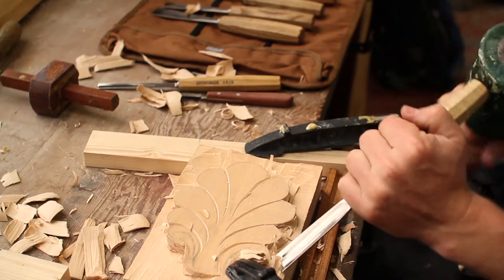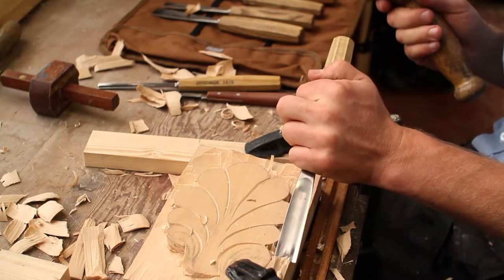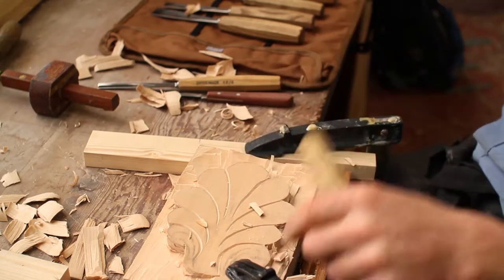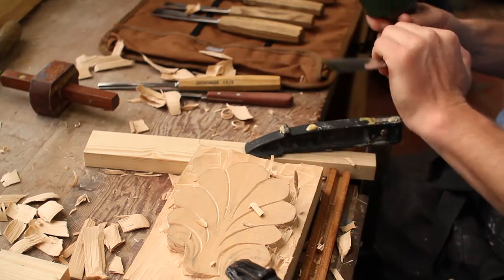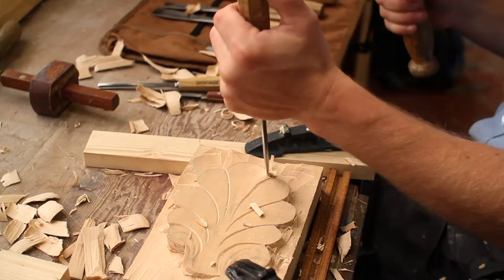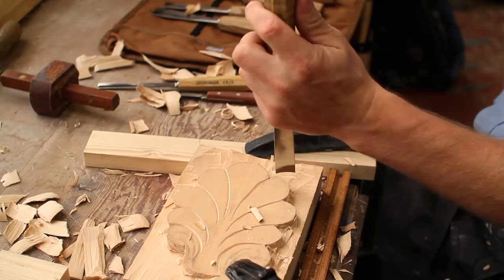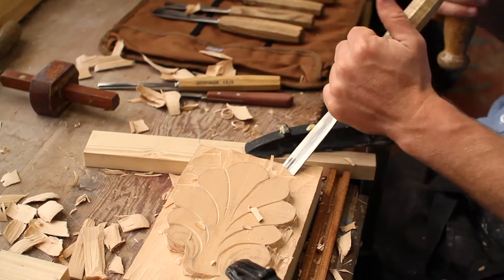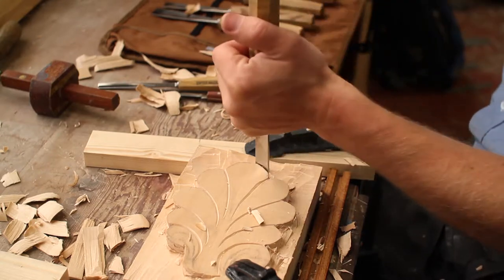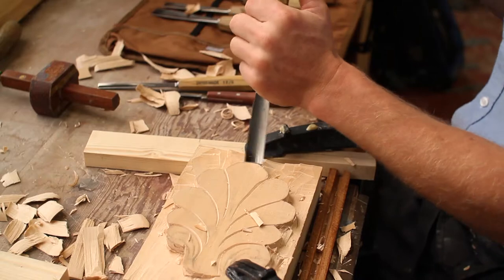It's quite a fine art with using the chisel at this stage. I'm hitting the chisel hard, but I'm never going deeper than maybe 3 or 4 millimetres with the cut. If you continue cutting more than that and strain it too much, you'll end up with loads of nicks on the end of the chisel — and that's often what students do. They'll be hammering it just as hard, but instead of stopping when you hear a certain sound that tells you not to go further, they end up continuing and that's when you nick it against the grain.